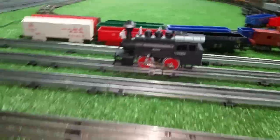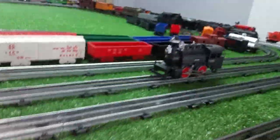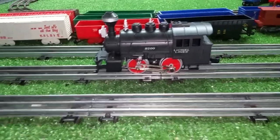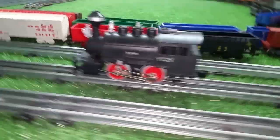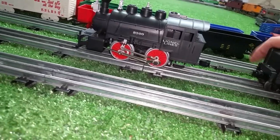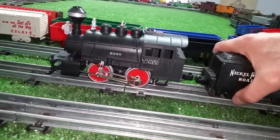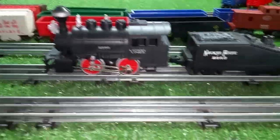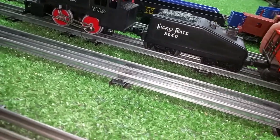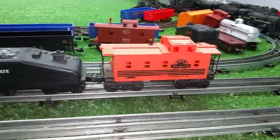Diodes — it's a good trick to know. I did some reading on this locomotive and found out it was DC. So I had this lock-on prepared and just hooked it up onto a single diode. I'll pull this apart and add a diode directly to the motor. I went through some of my junk parts and added a Lionel coupler to the front of this tender, and I've got a Lionel caboose. So there's the switcher, the tender, and a caboose.